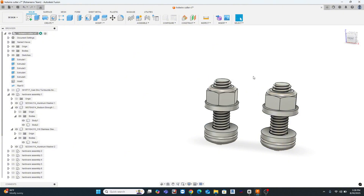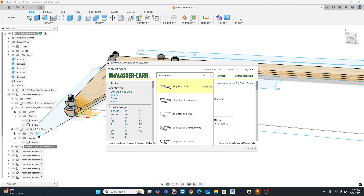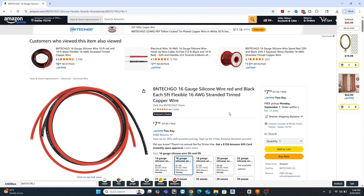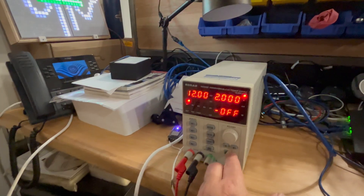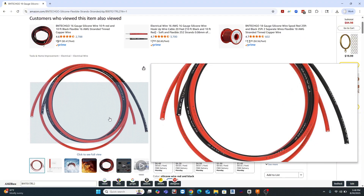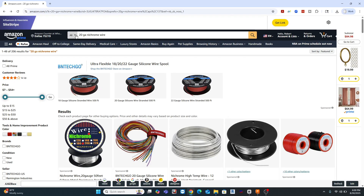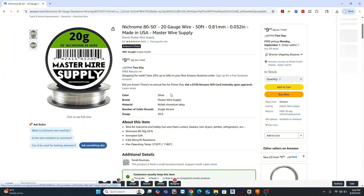The benefit to this is I can swap out nested components more easily if I decide to change something. In this model, I'm going to need this exact assembly about nine times. I'm also going to use a couple of alligator clips, and I'll need a stranded wire of enough gauge and length to go back to my power source. I found later that I'd also appreciate having enough length to move those alligator clips freely to any position on the wire, so I'm only heating exactly the part of the wire between the two clips. I would recommend a silicone-covered wire for this part. Stranded 16 gauge worked fine for my needs. We will get to power supplies in a moment, but mine requires banana plug-ins on the wires. The nichrome wire I used is 20 gauge. There are links for all of this in the description and the blog link where you can download the parts for cutting.